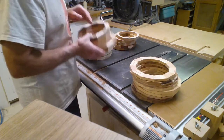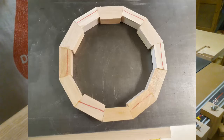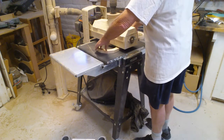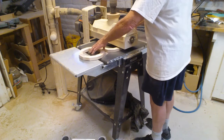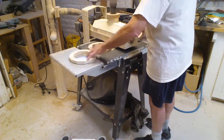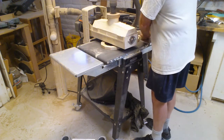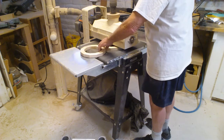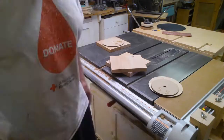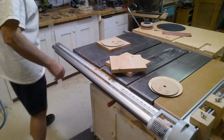Here's one ready to go — you can see I'm not worried about the inside being bigger, and you can see my red line and my not-red line; that's why I glued them together. Here I am on the sander. I've found I can work three rings at a time pretty well without breaking any. If one falls off the end of the table it will break. So I do no more than three. I do back and forth, then drop it down one sixteenth of an inch.